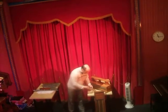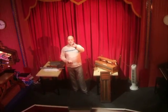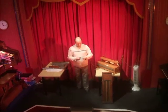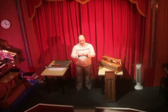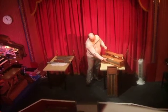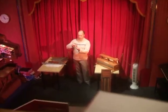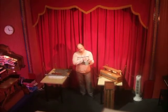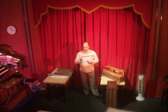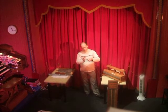The way it works, inside the magnet we have a hole at the magnet coil itself and a larger hole at the other end. The air outlet that the little armature covers sits over the poles of the magnet. The wind inside this chest, which has magnets on the front, is obviously pressurized. So this little disc is forced against the inside of that hole, making the circuit of air through the magnet airtight. So the action inside the chest is kept in the off state. You apply voltage to the coil, the armature moves, and it allows the air to exhaust through this hole and out through that one.